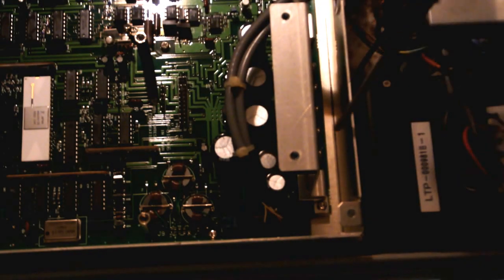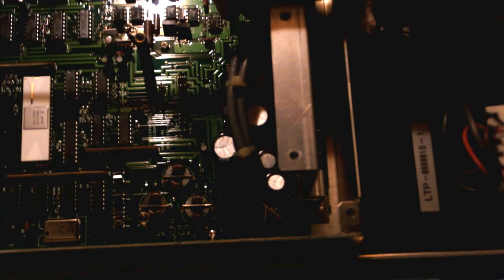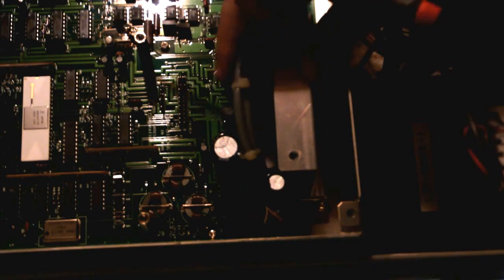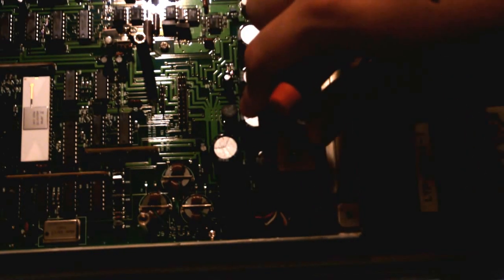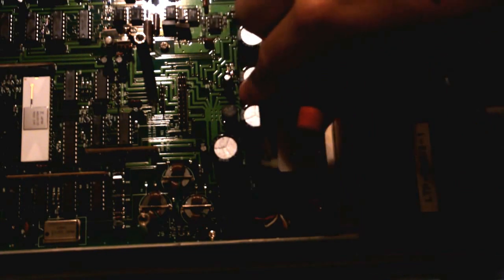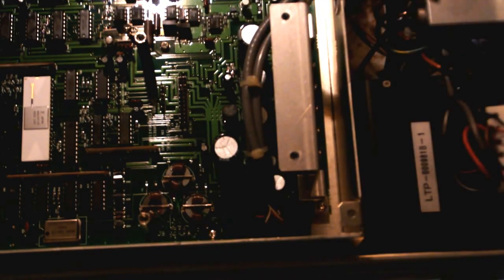I suspect they're probably linear voltage regulators. I don't see enough resistors around this section that they would be setting up dividers or anything for a custom, self discrete built linear regulator. So two bridge rectifiers and five, I think, linear regulators there.